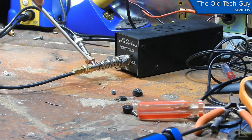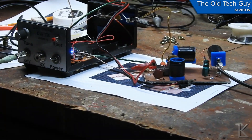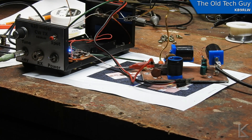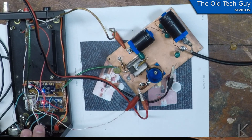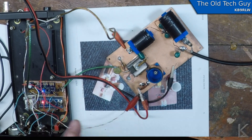I've got a BNC-T here tapped for the oscilloscope so I can watch the output, and I've got the VFO still in the old chassis here just tapped into the PA for testing. I've clipped in power, so we're all ready to test. At idle, we're drawing 60 milliamps, which is the current draw from the Arduino and the SI5351, and maybe just a few milliamps trickling through the power MOSFET on the amp, but not much at all.